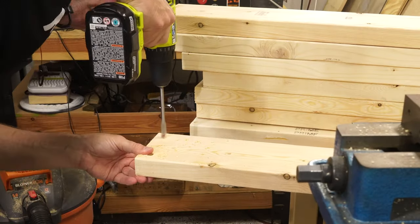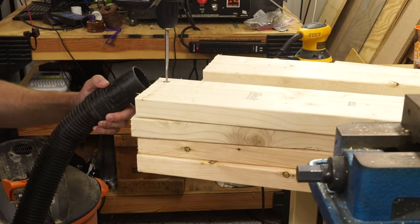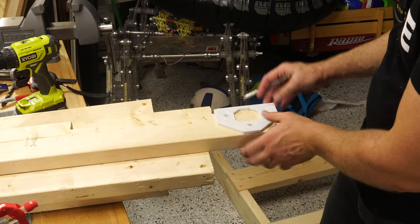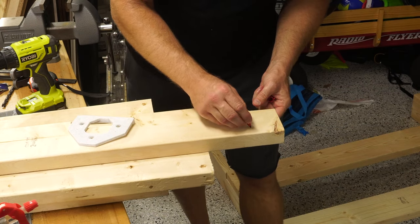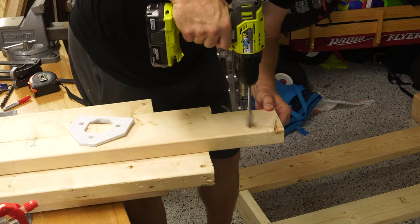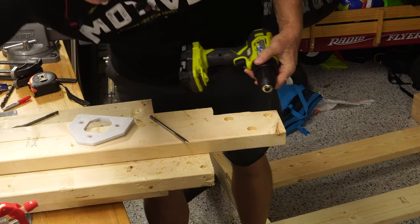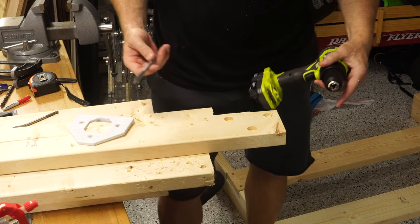What I'm going to do here is mark this using the jig, lining up with the top, with this 7/16-inch paddle bit. I'll mark it like so, and then drill it to 3/8 of an inch with this 13/16-inch paddle bit so I'll have a bit of a recess in it. Then I'll change up to a 7/16-inch bit so the bolts can actually fit through there and rest closer to flush. One thing to note: when you do this, you have to make sure that you don't cut the four pieces on the wrong side because they can be mirrored — I've certainly made that mistake before.